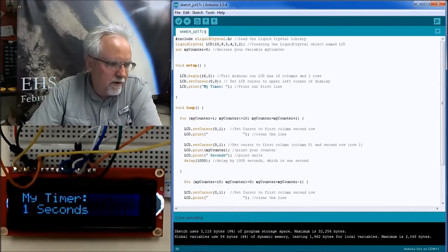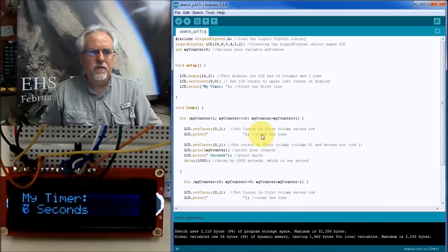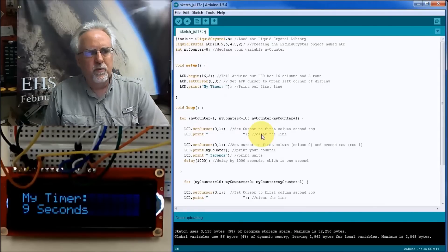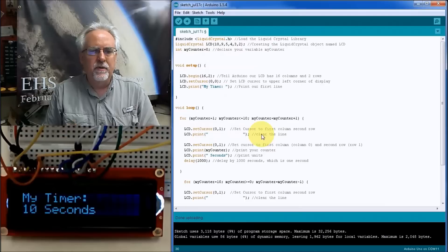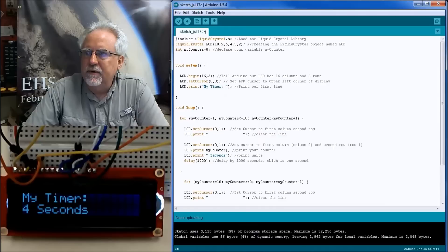So you can see it's really pretty easy to use these displays once they're wired up — the hardest part is getting all those wires hooked up correctly. The online tutorial at toptechboy.com Lesson 19 covers the details. Remember: include the library, tell it which pins are used, turn it on with begin() specifying columns and rows, always set your cursor, and sometimes print blank lines to clear ghost characters. We're ready to move on to Lesson 20 where we'll hook this LCD up to our ultrasonic sensor. Thanks a lot, and I hope to see you shortly at Lesson 20.